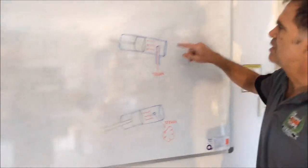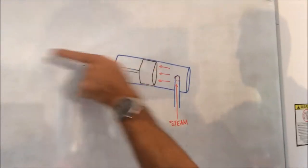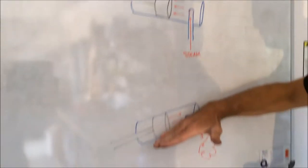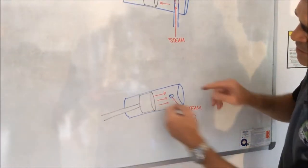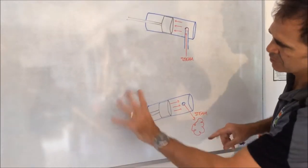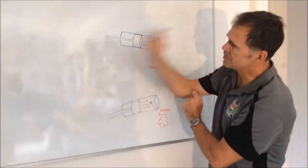I've got a diagram over here. In the up position, the steam comes in through this little pipe into the cylinder and pushes the piston out. When the wheel turns and the cylinder rocks into the down position, the hole in the cylinder aligns with the exhaust hole. The momentum of the flywheel pushes the piston back into the cylinder and the steam comes out of the exhaust pipe. So this phase — steam pushing the piston out — is what provides the power that kicks the flywheel over.